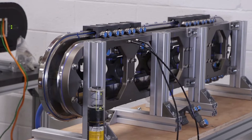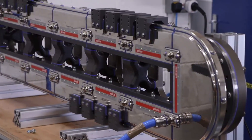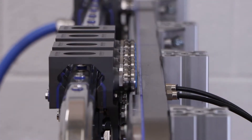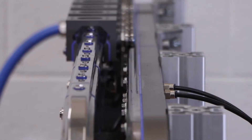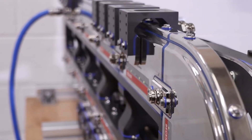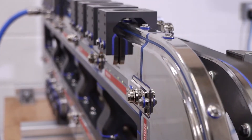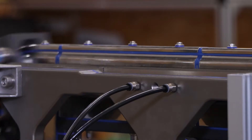Here we have our hygienic design. For a hygienic application, simply being waterproof and chemical resistant isn't enough. We need to make sure there are no tiny gaps — no gaps smaller than four millimeters. All gaps in the system need to be cleanable so nothing can accumulate. Water can't be allowed to trap anywhere to grow bacteria. We also need to use stronger chemicals on the entire system.